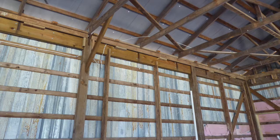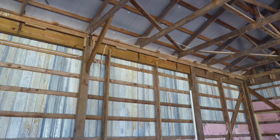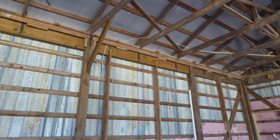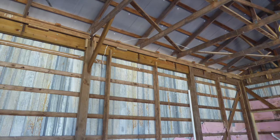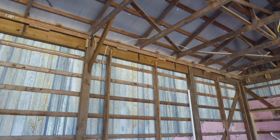And if you look at this picture, you can see a number of small white sun dots in the roof panels. That's because my outside panels were used previously and had screw holes in them from where they were previously attached. And that's what the little white dots are. Fortunately, the screws were put in at the top of ridges, so most water would flow down between the ridges. Second, I later went up on the roof and on the sides of the walls and closed in all those holes with silicone. The result is I've had no known leaks.